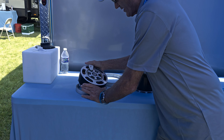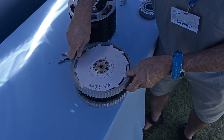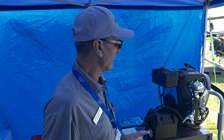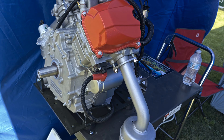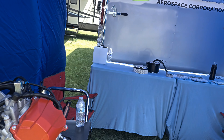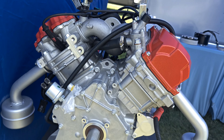If you look at how we're doing this, we're taking an electric motor — you can see a couple different sizes here — and we mill out these rings. There's a lot more hardware that's not here, but we mill out these rings and put them on, and just make more of them and more belts if we need to scale this up, because we will be scaling it up. We may be flying with the Predator, but that's not really our objective. That just was the easy, quick place to start. This is our classic V-twin, 60-horsepower, four-stroke engine that we supply for the Merlin and other aircraft. And that motor on the table is about the right size — that being 30 to 40 kilowatt — which would form the upper pulley of the reduction drive. Those components are in production and development now at the millers and fabricators.